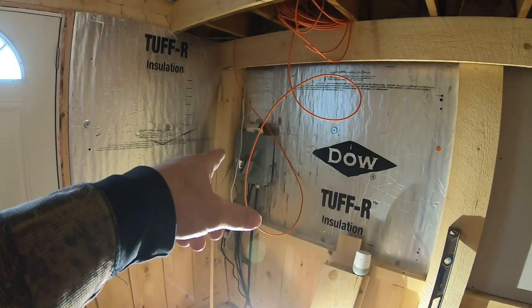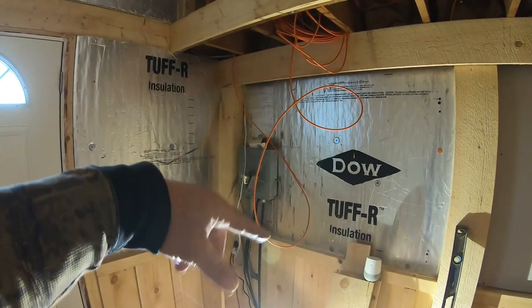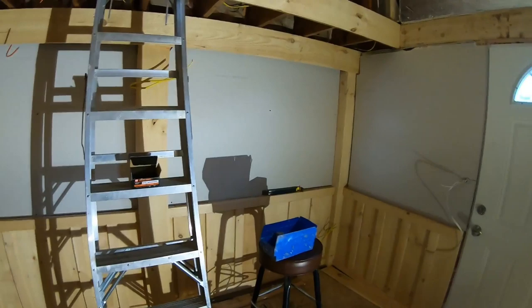Open that hole a little bit more, get that screwed in. I gotta take that panel back off, get the sheetrock behind there, but I gotta take it off and take a piece of foam out. Put some more wood blocking behind there because I didn't do that — only got a two-by-four for blocking. I want to put at least a two-by-six so I could put two screws in that.